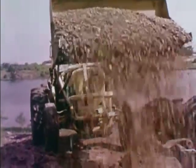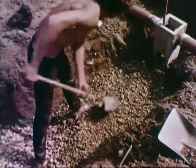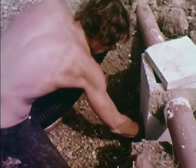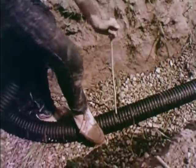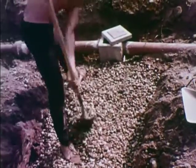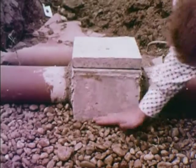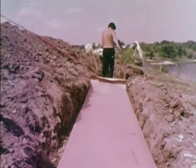The required gravel is placed on the bottom of the trench and leveled to the required depth. The tile is placed in the drop box and must be held in place by rods before the gravel is placed on top to prevent sliding of the tile. The gravel is then leveled again, making sure that none of the gravel is higher than the flow line out of the drop box. Untreated building paper is placed over the gravel.